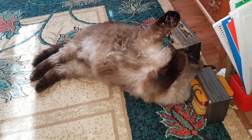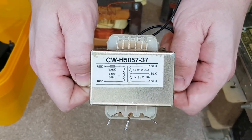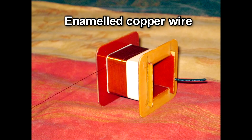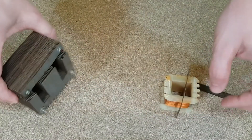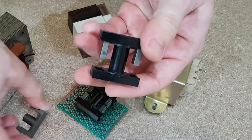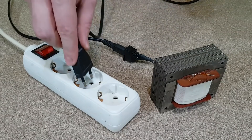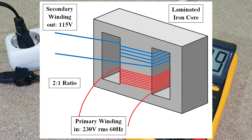What is a transformer? The simplest definition is this: a transformer is an electrical device that transforms an input voltage into one or more output voltages. It only works with alternating current. You have a primary winding made from insulated copper wire wrapped around a ferromagnetic core. This is usually made from silicon steel sheets shaped like the letters E and I. When you connect the primary winding to mains voltage, the AC going through the copper wire creates a magnetic field in the transformer core.